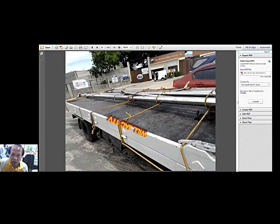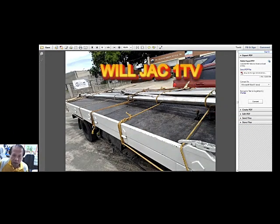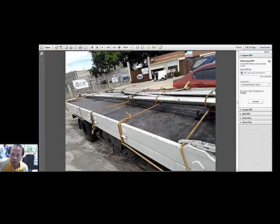Just recently, a client in Batangas also received our delivery for these stainless steel poles. So today, we are now suggesting the use of stainless steel poles. Well, the client is very close to the sea, so we have to recommend to them the use of stainless steel pipes instead of the usual galvanized iron pipes or GI pipes.